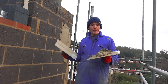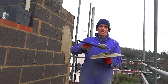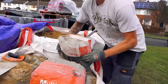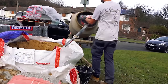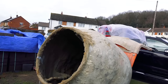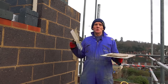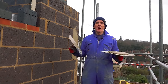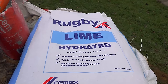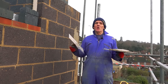Certainly it won't do any harm in the base coat. But when you do the top coat, my recommendation is keep it nice and sharp and keep that lime in there and you won't have any trouble. One part of cement and one part of lime — that is hydrated lime. It's important that you don't put any more than one part of lime to one part of cement, because hydrated lime — as opposed to hydraulic lime — will not set on its own, so you need that cement in there to help it set.